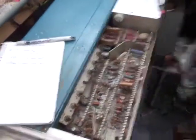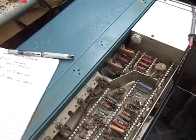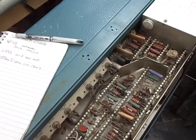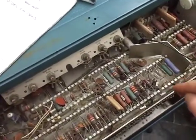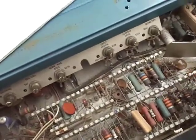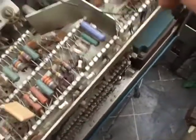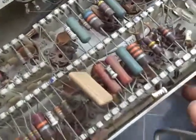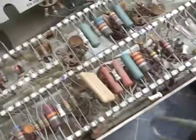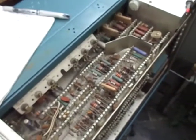So what about DC conditions? That's what I usually check next — we're going to have to check DC conditions. I could really do with getting the printer fixed to save running in and out of the living room. This neon is still not lighting — I did check the voltages across it. I've checked the resistors underneath and they're good. One thing — we'll change V173. I don't know, I'll have to think about it more later.